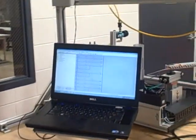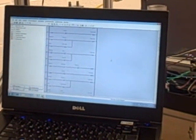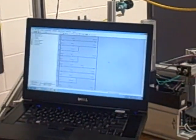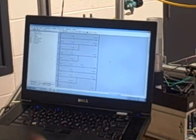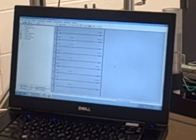Here's our program for our controller. We use the EasySoft software so that we can make it so that the hitch knows whether it's on the top right, the bottom right, or bottom left. Then once we hit our stop four times in a row it'll know to go to the home or the center position with those sensors. And this is what makes it work. We have 41 lines, so we maxed it out. It's a pretty intense program.